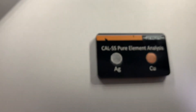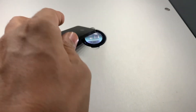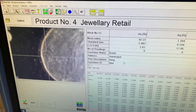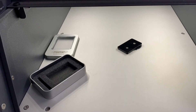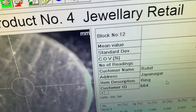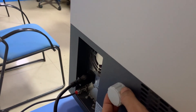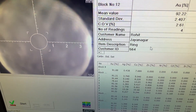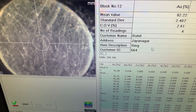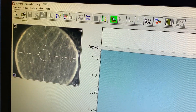This box is to calibrate the machine. It contains two pure metals: silver and copper. We will keep these two metals one by one. Right now I have placed silver, which is showing on the screen. Let's close the lid. There is a knob on the left side to put the metal in focus — you can reduce or increase the focus and adjust it as per your requirement. Now it is in focus. It gives a magnified view so you can see all the scratches on the metal.